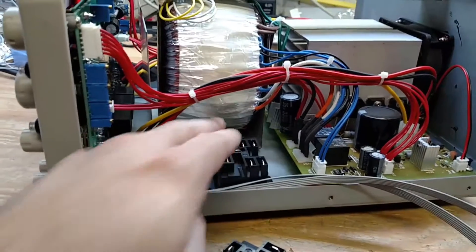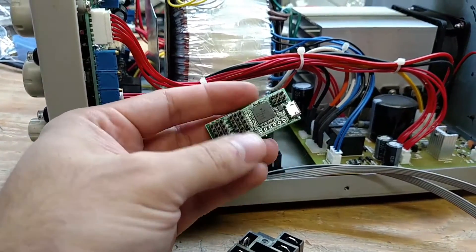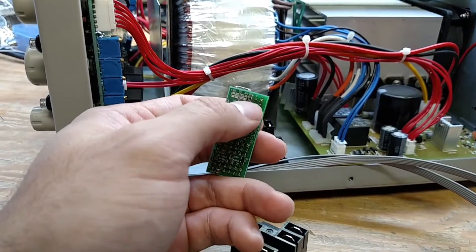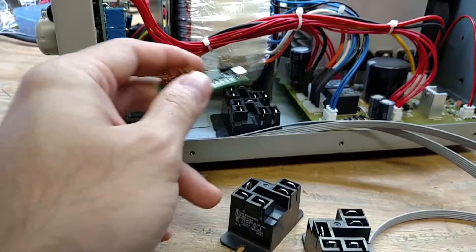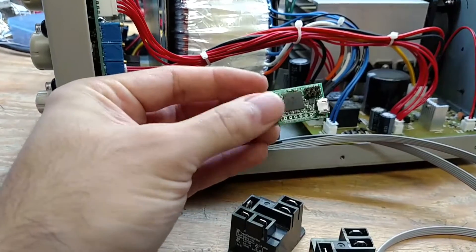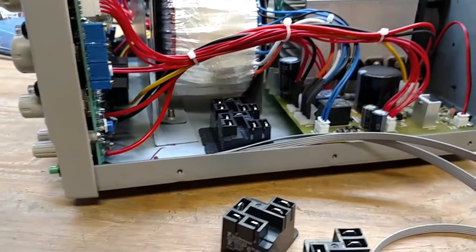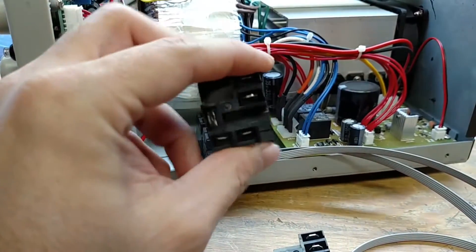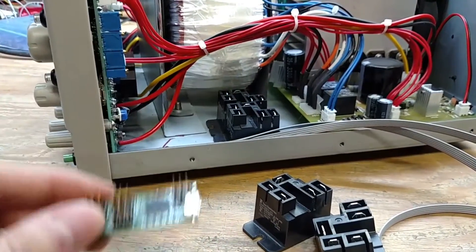To actually control the relays and read the switches, we're going to use a microcontroller. We could do it discretely, but I want some extra features. This is my standard little servo controller board — you can see the pull-up resistor pack and the resistors for the five buttons, and it has four outputs to drive the four LEDs and four more outputs to drive the four relays. I'm also adding a breakout board with opto-isolators. I feel safer having the micro just turn the opto-isolator LED on and off, and let the transistor handle the voltage/level translation to power the relay — that way, if something goes wrong, the micro isn't exposed to 20-something volts.